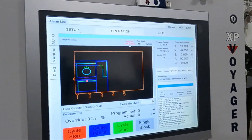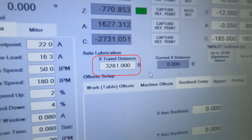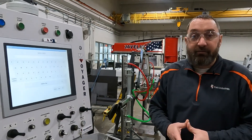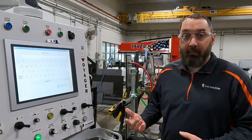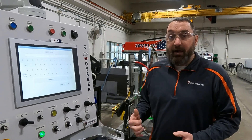To start out we're going to go to our setup screen, then advanced setup. In the center of the screen — this is on a Voyager, it may be different for a Titan — the x-axis travel distance is set at 3,281. We're going to set this to zero, which will make the greaser pump grease. Otherwise it only pumps grease every 3,281 feet that the x-axis travels.